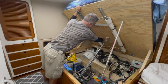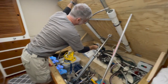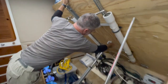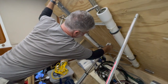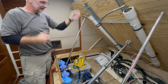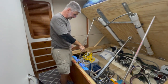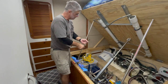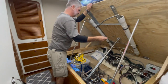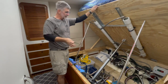There are two mounting blocks — one on each end — held in with an Allen wrench screw. I'm going to take both of those out, then with the linear actuator still activated, retract it a little bit, pull it out, put the new one in, wire it up, extend it until it fits the right distance, put the screws back in, and I should be good.